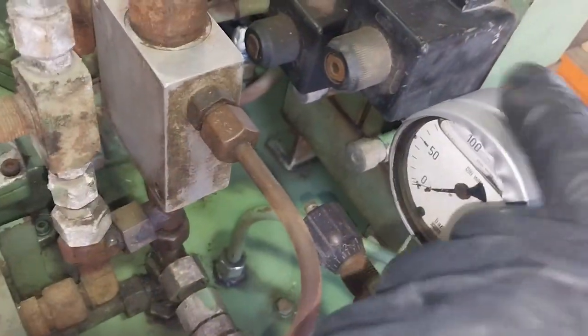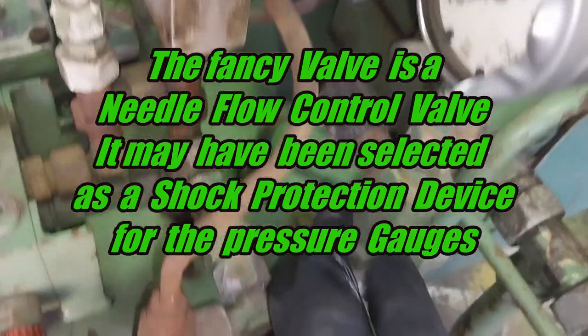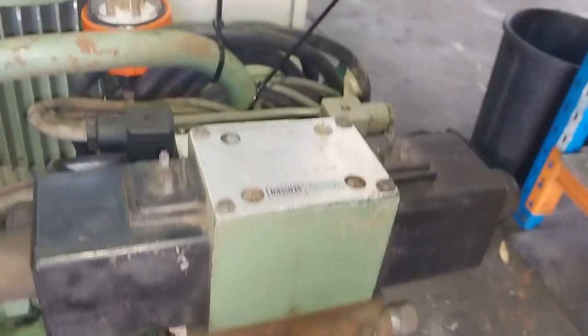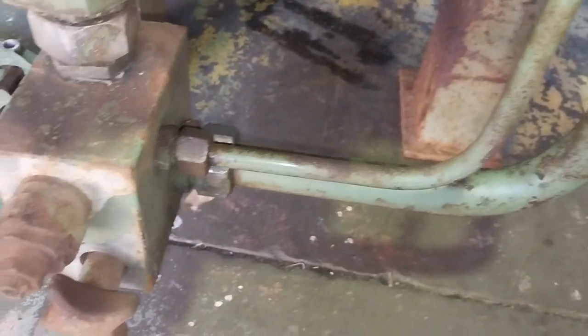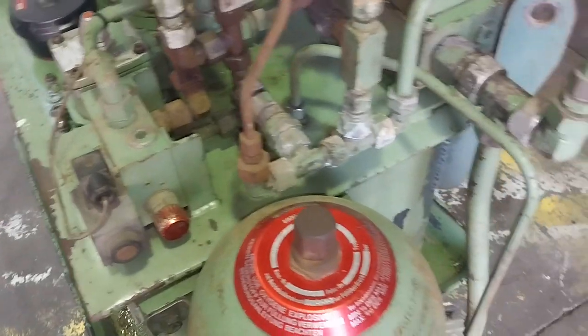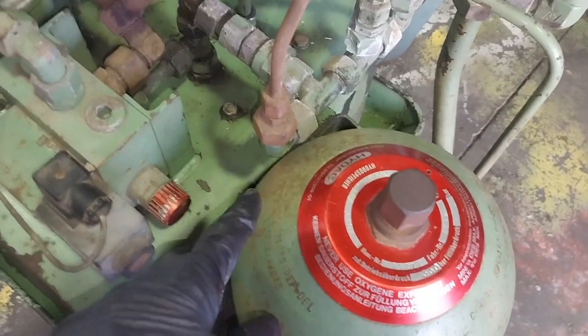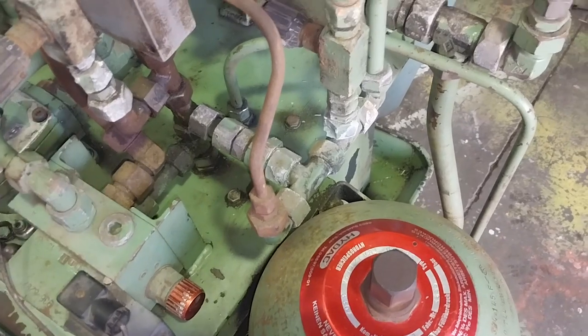Coming out of the pump, continuing on — there's another pressure gauge up here with another fancy isolating valve. Coming through there into these two big valves, and it can also go down into the bottom of this accumulator and up into the oil side of the accumulator where the bladder is. You've got a set charge, you reach a certain pressure, this is potentially half full of oil, and then the relief valve sends excess oil after the accumulator is charged up — so this is on a recycle loop under pressure, back to tank.